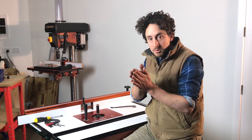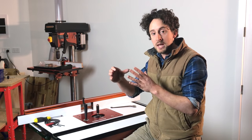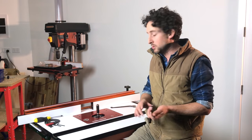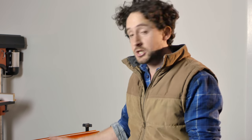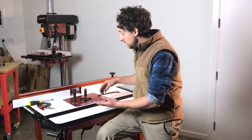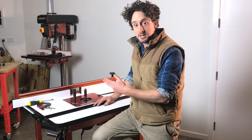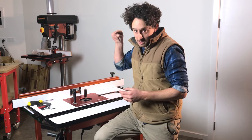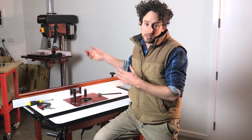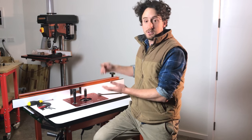This lifting mechanism is designed so that a full rotation is exactly two millimeters, which means you've got smaller gradations to get really accurate adjustments in height. There's very little slop in this screw — you feel really good tension, which means that when you move it, it's not falling back into position. There's no looseness in that mechanism, and when you tighten it off, it is well and truly locked. I can vouch for that — I've used this over a number of years in a professional manner. To change the bit, you bring the height all the way up, make sure that the on/off switch underneath is disengaged so you can reach full height, so that the spindle lock engages, so that you can then undo the collet.